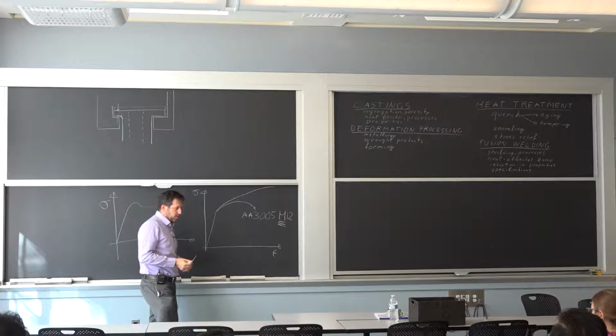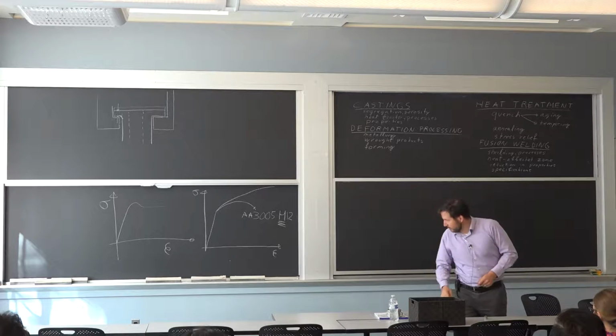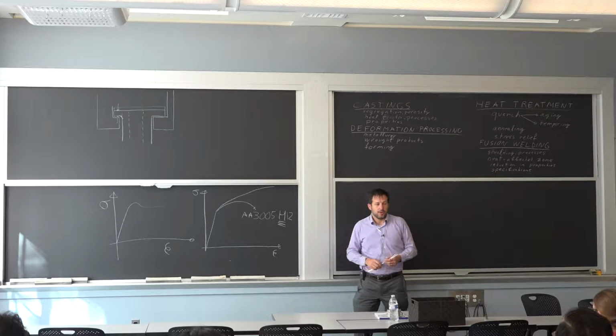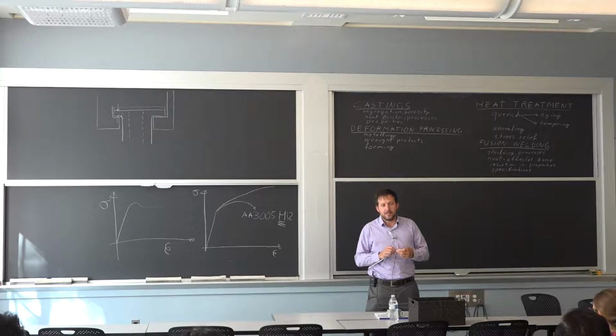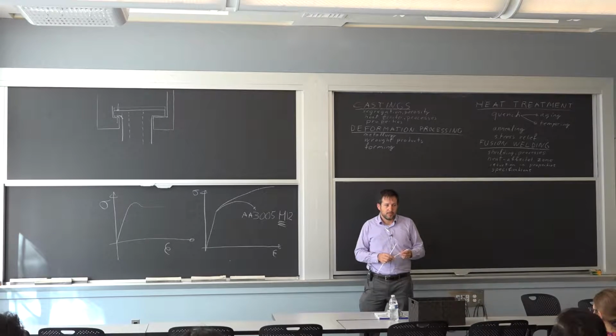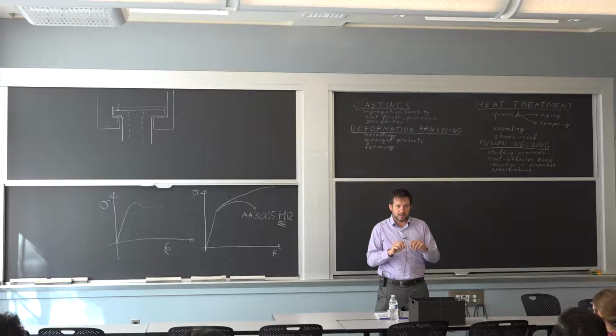So this means that it's being cold formed. And it's very useful, just even in terms of machining. We have some stainless steel parts where you get the wrought product in hardened condition, but if you're going to try to machine it, it's a lot easier. Otherwise, let's say I want to change the entrance to this, create a little chamfer and make a connection. If it's really soft, I can bend the whole part by the time I'm done, just in handling and trying to do the work. So I want this part to be hardened at the beginning, and then maybe for the application, I was talking about medical devices, probes that need to be flexible. So that's an example of a tube that is very flexible.